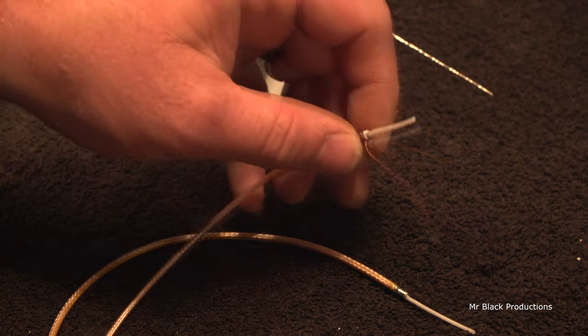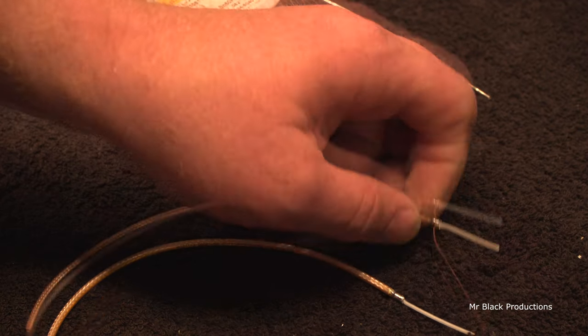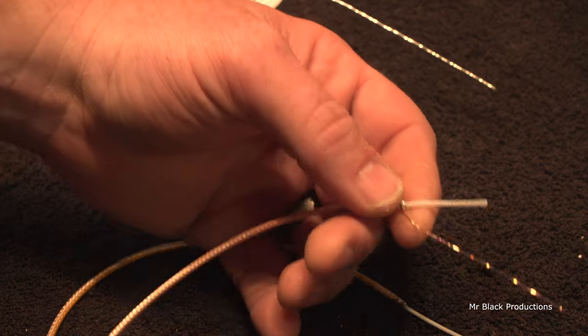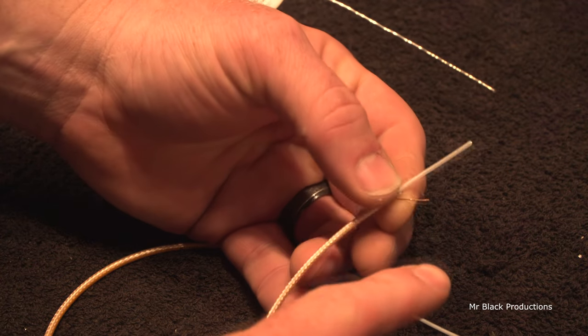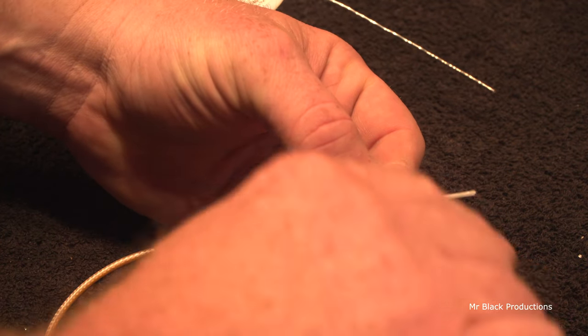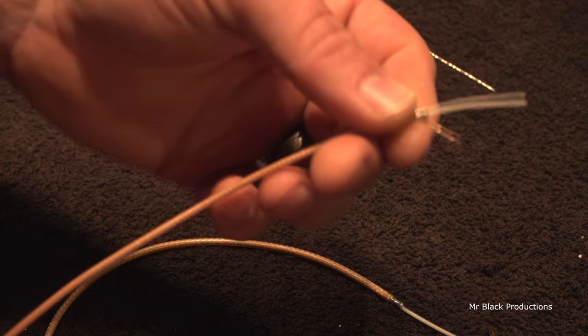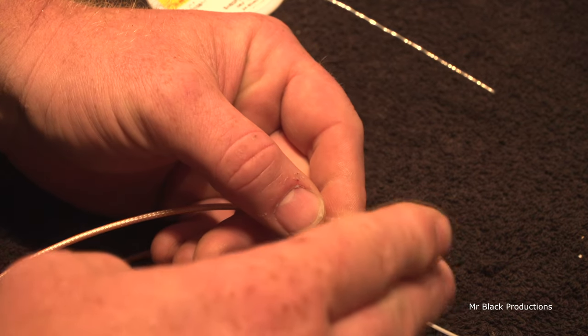Me personally, I'd rather go to ground and have a little bit longer inductor to go up to my connector. But on the back of that 667, what I like to do is put this little ear on it. I'll cut it so it's about this long. I'll solder to the tab, and then I'll take the lead, fold it over, and go back down to the coax connector. On the other end, I create a pigtail just like this. The ground lead, positive lead, trim it.